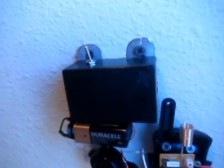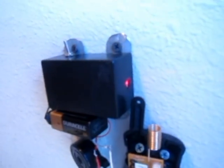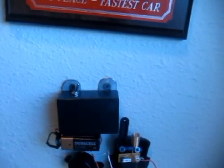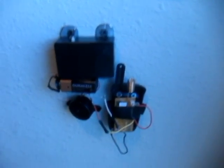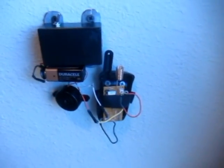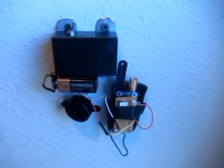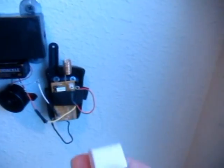I'm just using a standard laser alarm circuit — my photo cell right in there, on/off switch — but I added my own little twist to it because I need to be able to get in the room without the alarm going off. So if you come in late or something and you don't want to wake up the kids, I installed a relay delay circuit that cuts off power to the laser alarm circuit whenever I press this button.